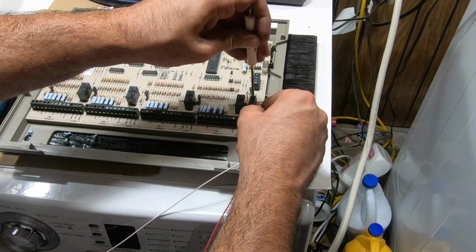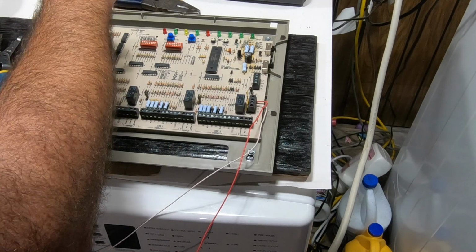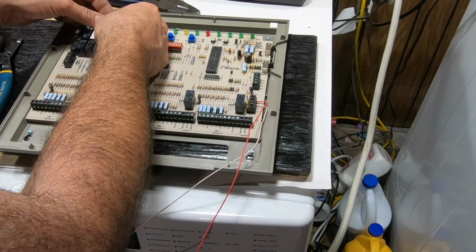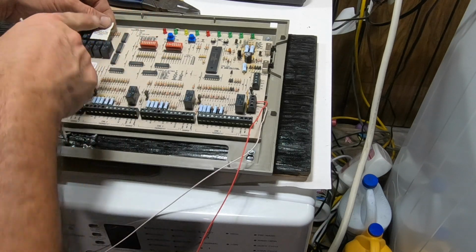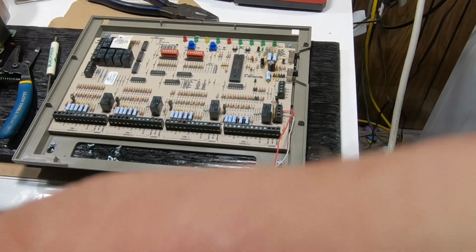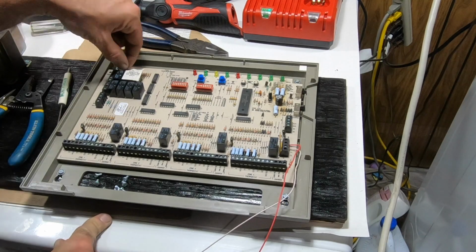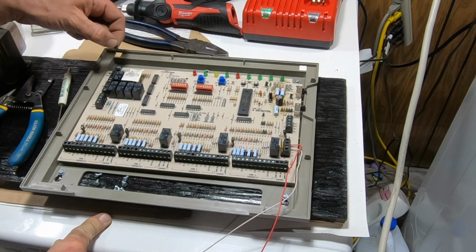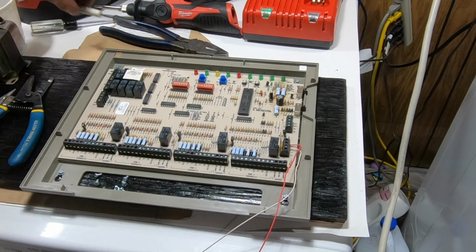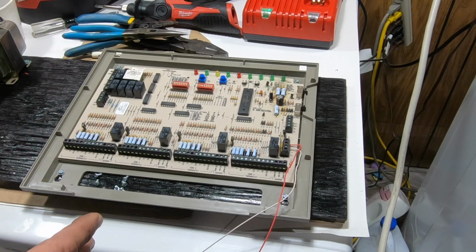This board did not have an outdoor sensor, it did not have a discharge air sensor, it did not have any of those things. Okay, I didn't lose any of my wires for R, R, C. Now, I forgot to read it before I ripped it. Remove RC RH jumper when using dual transformer systems. That's so true for this, or even just standard thermostats. You don't want to have two different transformers colliding power. So remove it for a dual transformer. I don't have dual. I have a single. Interesting that I have that there. But this has been working for all this time, so I'm not going to reinvent the wheel on this job site. So for now, I'm just going to turn it on and see.